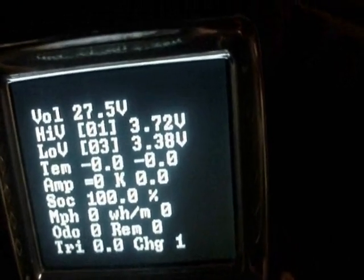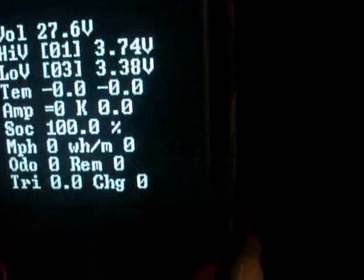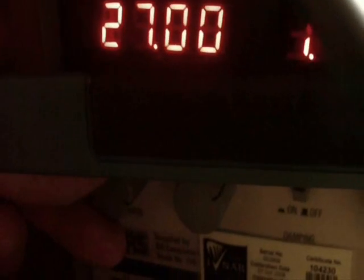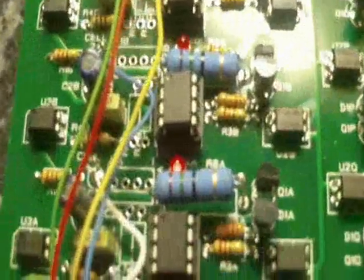Normally the system would be throttling back the charger. We have an alarm — we've done a VMAX on that cell, which is quite interesting. Let's throttle back our charger a bit. Oh, a little bit too far I think. You can see our shunt is just still on there, and we're starting to pull that cell back down.